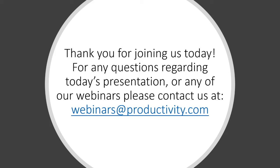Okay, thank you. How fast can you safely feed in 9810? Well, I usually go 100. In these examples I put it at 75, but I usually go 100. I think you can go more than that. I guess I don't know the exact number on that. I don't know, Bill, do you have an answer for that? Their published thing just in the Renishaw inspection book just says the maximum safe fast feed rate established during installation. So I'm guessing it goes as fast as you can feed on the mill. But normally we operate somewhere between 50 and 100 inches a minute.